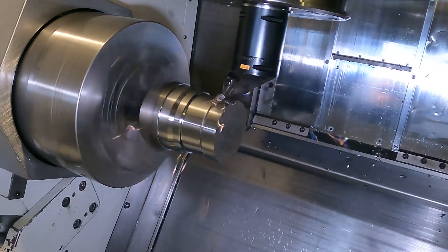We just saw some prime turning in action. It's all directional turning, but you get the best productivity from turning in the prime direction, which is not conventional. It's machining away from the chuck in most cases, and you get really good productivity, really good tool life, so you get more bang for your buck.